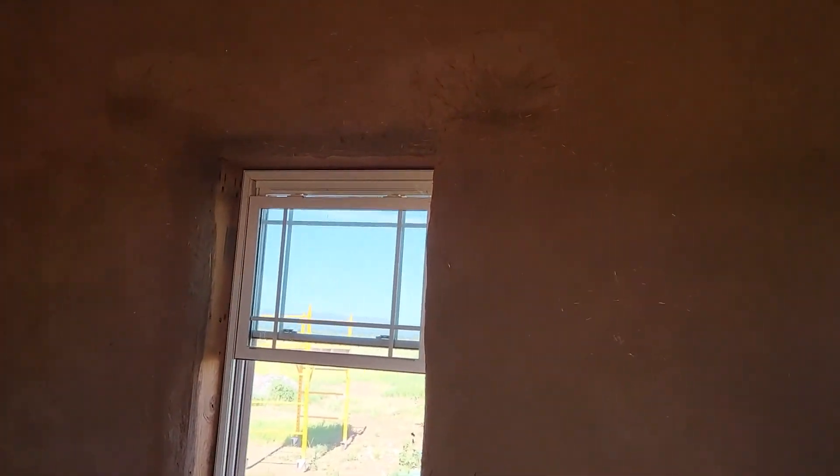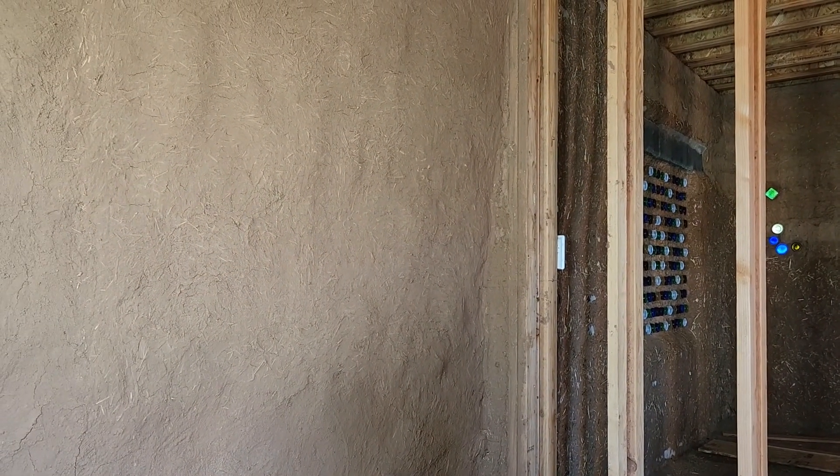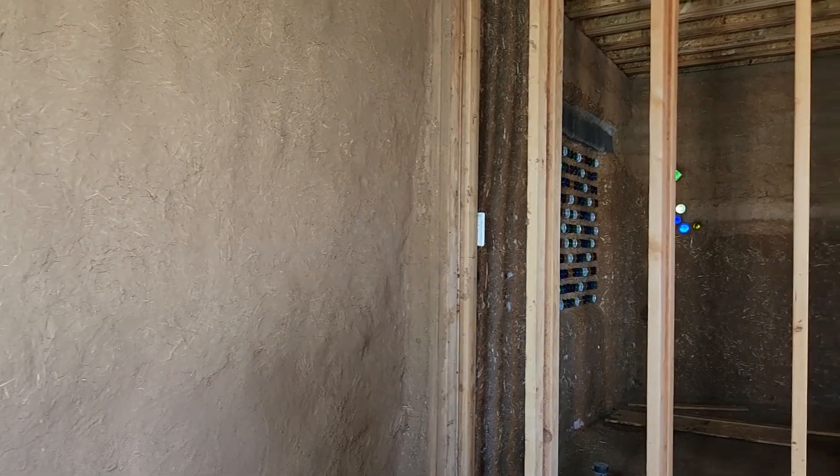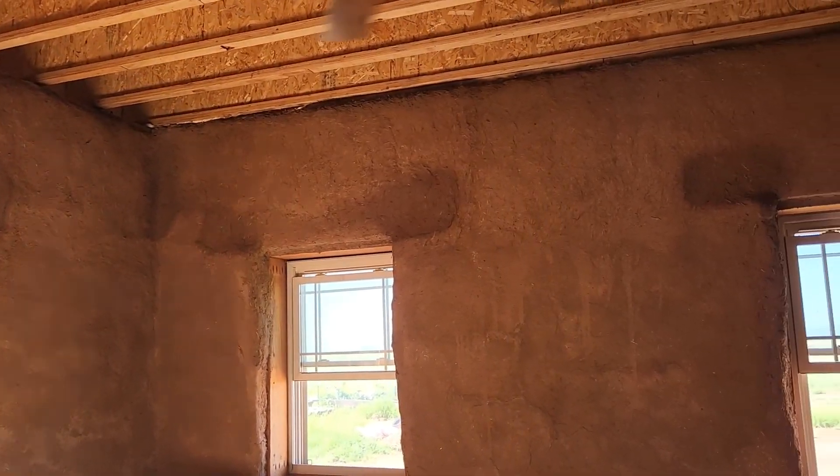Everything floor to ceiling — all done. Now there's still some fine cracks, but as I do more and more research on lime wash and lime paint, everybody says leave those because the lime wash will fill in those cracks nicely and it'll help grab. The lime wash will not be waterproof, but it's inside the house so it doesn't matter. It's also easy to make repairs if anything does flake off. So that's where we stand in the bedroom — I'm happy with it. It all turned out great.